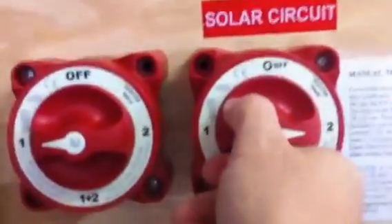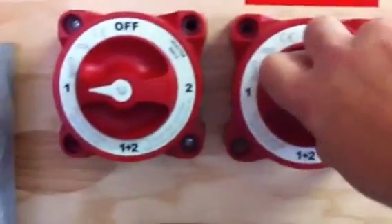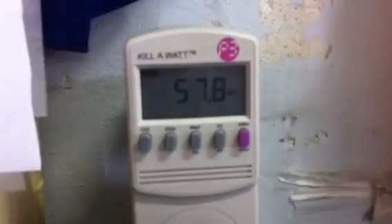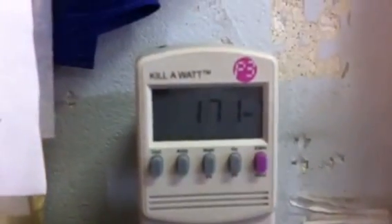Wind's kind of fickle now. I'm going to speed it up — I'm going to send a little extra juice to these batteries. So we're going to send the solar on into the battery bank too. This will speed it up. There it goes, and there's our watts from the wind. And then it'll go off divert mode — those watts will go right back to the battery. And then there it goes again.